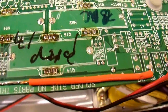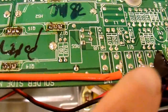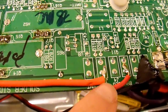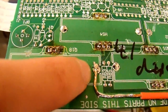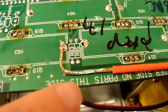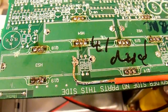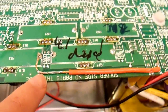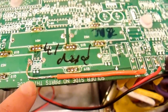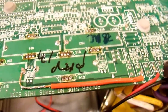I replaced those four transistors and I think it's going to be okay again. The fix I made on that power trace that was too thin is right here — I took a wire and ran it across from the connector over to this via, and also stripped the end of the wire and soldered it to the row of vias over here, to get a good path back to that chunk of copper. This wire isn't very thick — remember this trace has to carry at least 60 to 65 amps for this test.